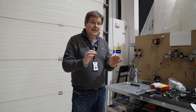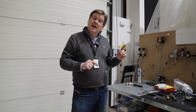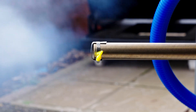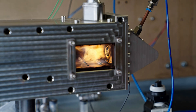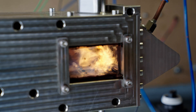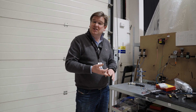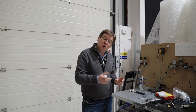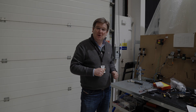So we've got that pretty much where we need it to be now — really, really positive progress. The next step, once we've got all of those things working together properly, is we're going to connect the emissions measurement equipment so that we can run the combustor through its full operating range and measure all of the unburnt hydrocarbons, the NOx, the CO, and the various other parameters to make sure it's working properly as a system throughout the operating range. Really pleased with how this has come together this week.